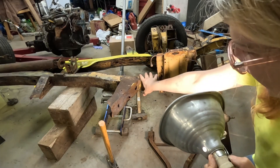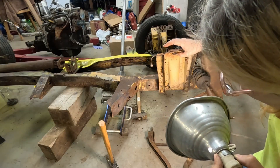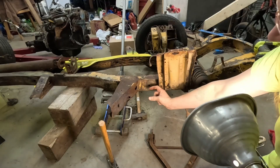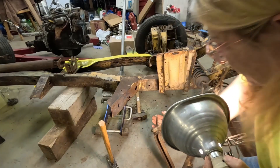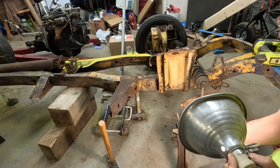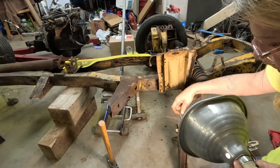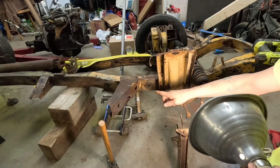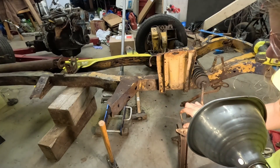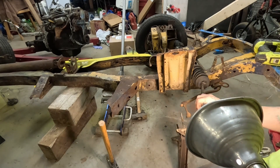I'm going to plate it and then it'll be stronger than all the rest of the frame. And we won't need a whole giant stack of shims. The other problem was the nut that went on the end of this — it would just barely go on, like the first four threads, because of the way this had to be shimmed. There was no more room for adjustment.